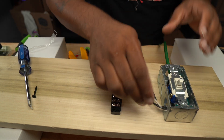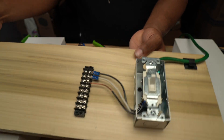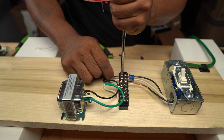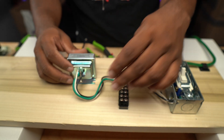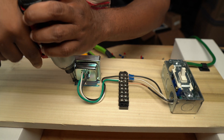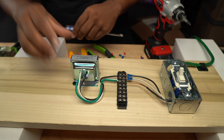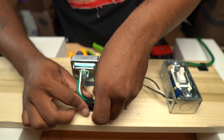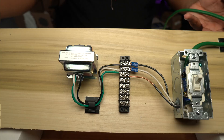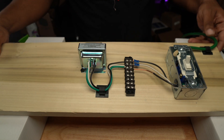I'm a perfectionist when it comes to wires, so I got these little cable wrap holder things — I call them sticky backs — you put them on and route your cables around them. That's the transformer you saw me get at the store. It goes from 120 volts down to 24 volts, 16 or 18 volts, and 7 or 9 volts. I went ahead and secured that. The good thing about this transformer is it's straightforward: hook your black to black, white to white, and green to green or bare wire. This is the finished product — it's really not that complex.